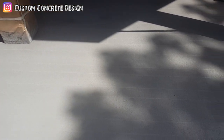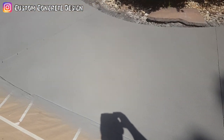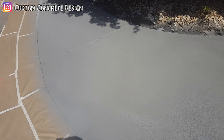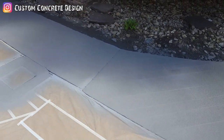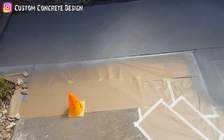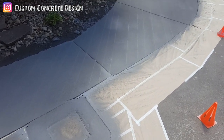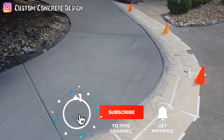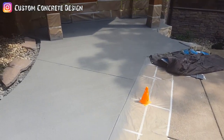We've got our tack coat on. You can still see the tape ghosting through the tack coat of concrete because it's just a thin layer. We'll come back in tomorrow morning with the texture coat — we do this coat in white because tomorrow we'll pull the coating over it. You can still see that tape quite a bit, but tomorrow I'll bury it. Then I'll pull the tape up probably tomorrow afternoon and we'll stain it Wednesday.